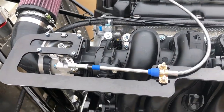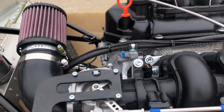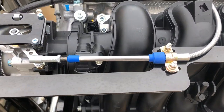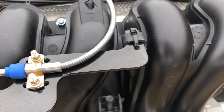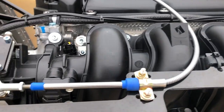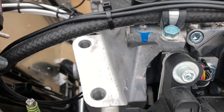Install your throttle cable. This one is just a shorty that's being borrowed by the builder in order to get the engine started, but the hook-up out here is the original. Hook it up here, and then the cable goes all the way around the engine and into the cockpit, clip it on, and set your idle right here.